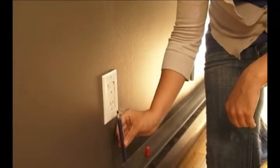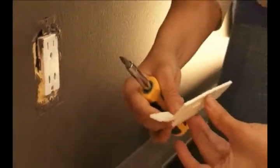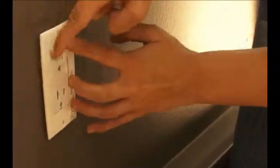The small openings like switches and electrical outlets are often the cause of energy losses. Test for air leaks in these locations. To correct the situation, use a pre-cut foam insulation in the shape of a switch or electrical outlet.